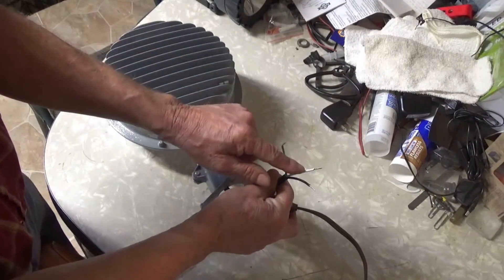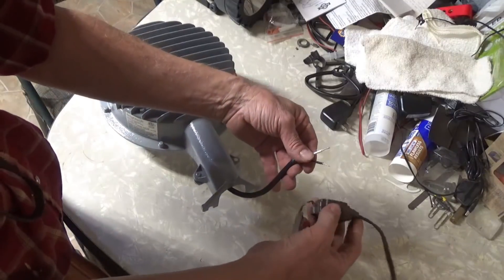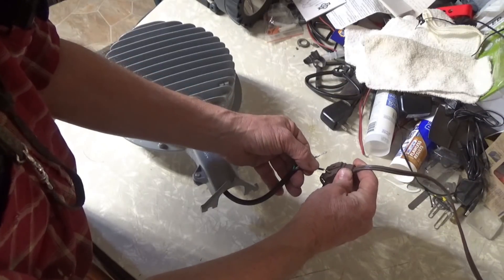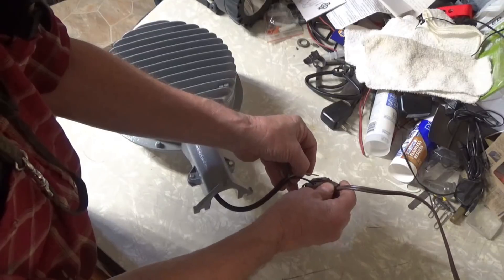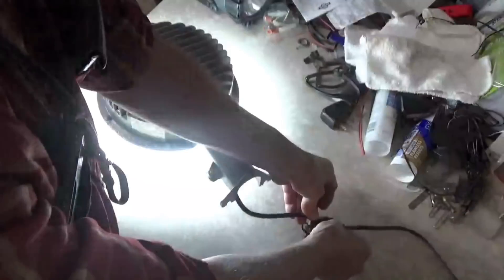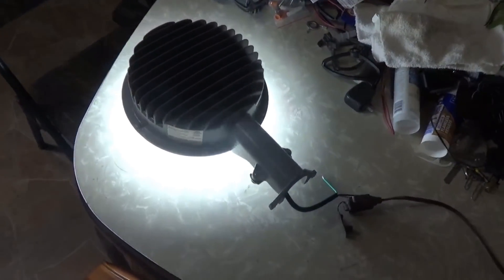I'm not going to do that. So I got an extension cord, it's plugged in. I got the white and the black wires — they were pre-stripped about a quarter inch but I stripped them a little more than that, closer to half an inch. I'm going to just put those in. This doesn't matter since it's AC — doesn't matter which one goes where. Just one and the other one here. Carefully try to make sure they don't touch each other in the process.